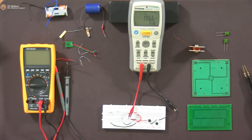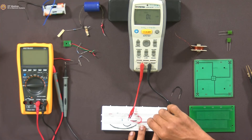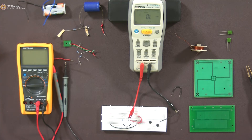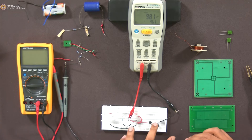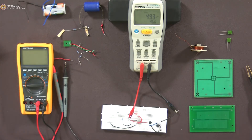Before breaking this apart, we need to do the parallel inductance measurement. Maintaining the same distance and using additional wires, the parallel reading is 49.3 microhenry — half of the individual values, as expected. The formula is L1 times L2 divided by L1 plus L2. So series and parallel inductance combinations work perfectly, provided the coils are not interacting and mutual inductance is negligible.